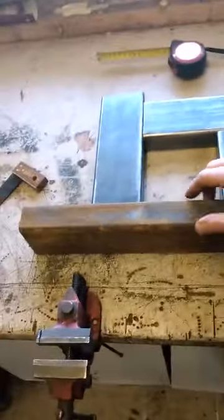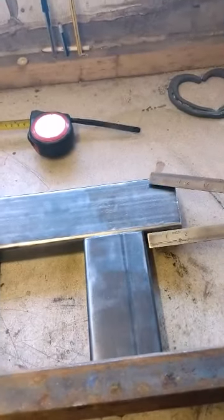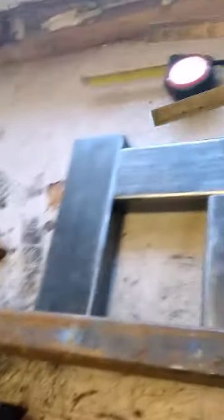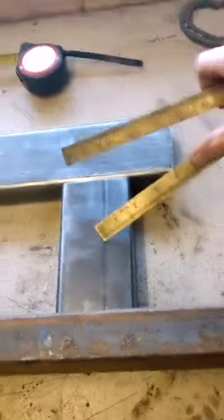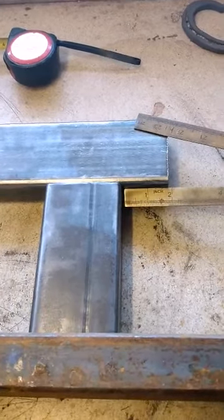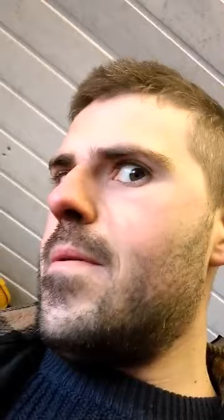I've prepared the chassis. I'm using this old box section as a flat — I had to get all the rust off it. I'm doing this in inches: it measures two inches from there, and both this bit and this bit are ten inches long. This one I've done six inches, and that goes two inches from the end. So I'll weld them up now and see what goes on.